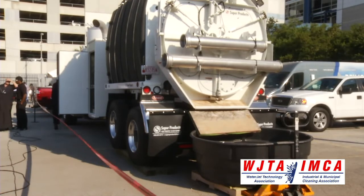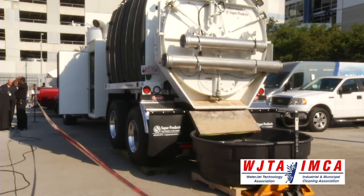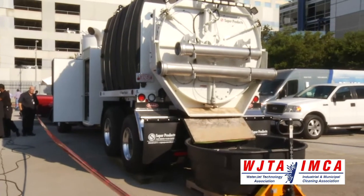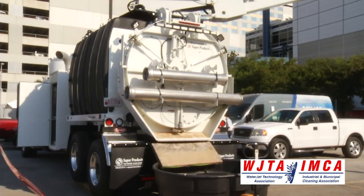At times when you're unloading into a containment dike and you're backed up on a berm, you're in a nose-down condition. With this truck, the ejector plate does a great job of unloading the majority of the liquid and the solids. But you're going to get a little bit of pooling potentially in the front of the debris body in this situation. So we'll show you at the end here the tilt function that will actually clear the remainder of the liquids when you're in a nose-down condition like this.